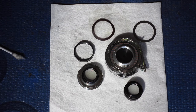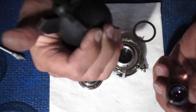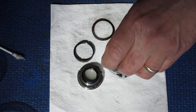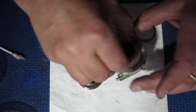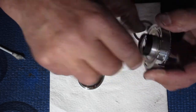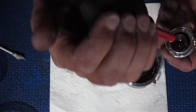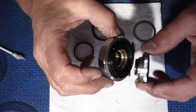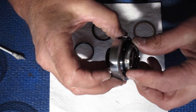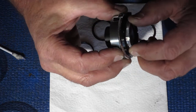I'm ready to put the lenses back on the camera. Starting with the rear group — all clean and ready to pop back — just blow any last bits of dust off and on it goes. Screw it in with your fingers, give it a tweak, it's done. For the front group, the bayonet's on; give it a quick blowout and make sure the red dot lines up with the red dot when you pop it back on. It just twists and clicks into place.